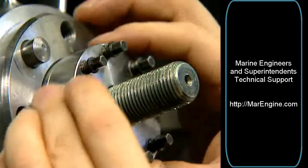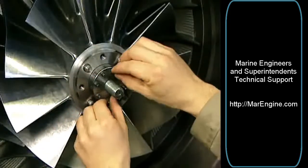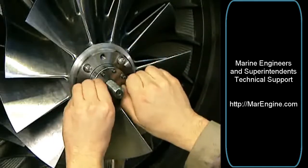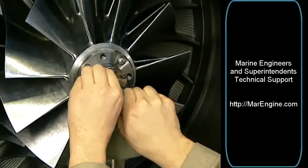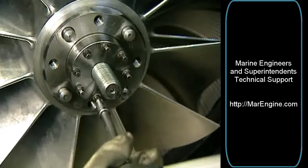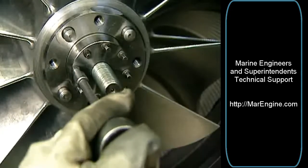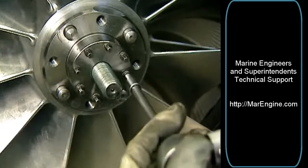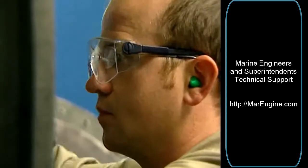Screw the tension nut onto the tension rod by hand. Screw it a quarter turn back. Screw in all thrust screws by hand. Then tighten 4 screws over cross with half of the tightening torque. Tighten the rest of the screws.